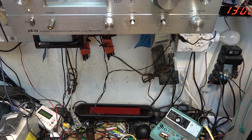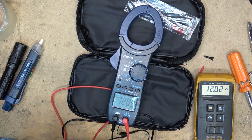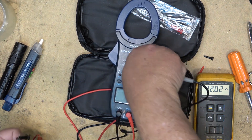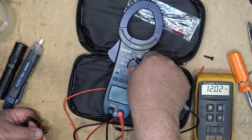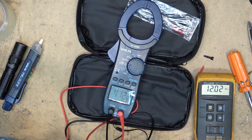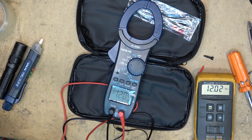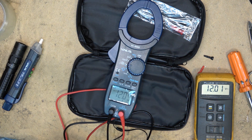In that respect it works like non-contact. Now we can put this into voltage mode. It reads 12.09 volts. When you first turn it on it's in AC mode, so switch it to DC and there's our reading: 12.09. The Fluke says 12.02 — they're both pretty close. My power supply says 12.0, but it only has tenths of a volt resolution.